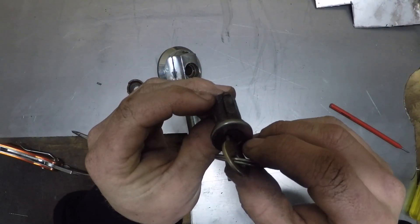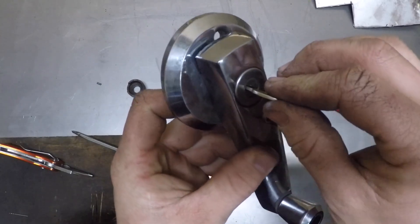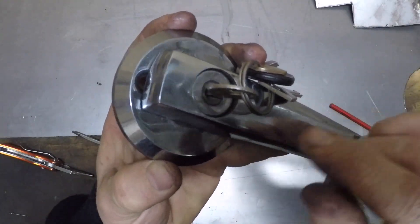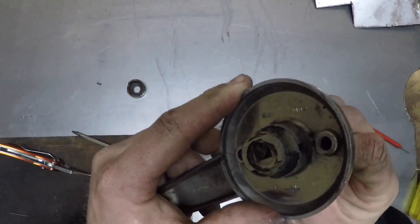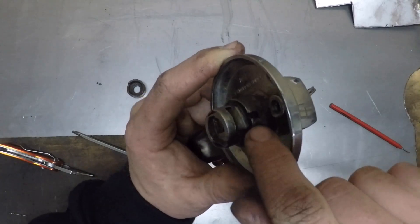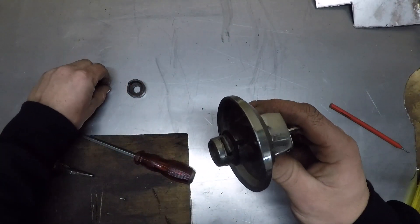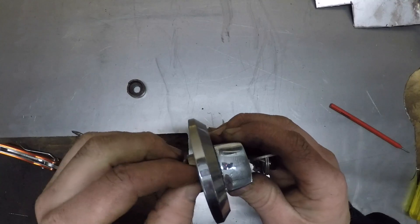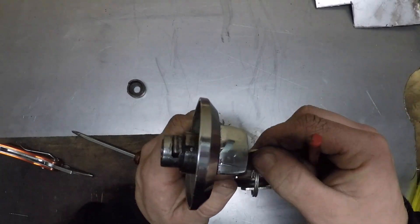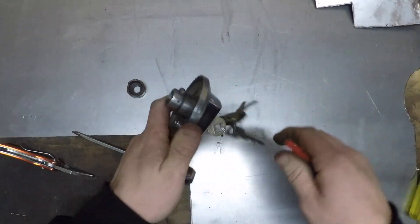The key is back in the 11 o'clock position. We'll put it into our barrel, press down, and turn it back towards almost 12 o'clock. That'll reinstate the key position. Leaving that pivot in there, we'll also reset the spring on the little locator — so it's back in there. To make sure the barrel stays in there, turn it back to the 1 o'clock position, push down on that, and then we're done. That barrel ain't coming out anyway.